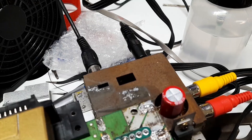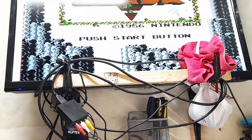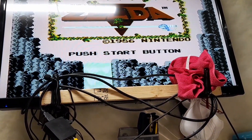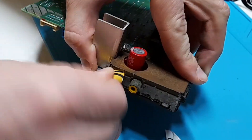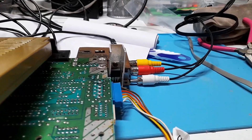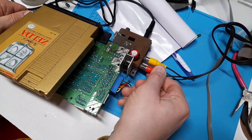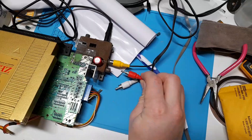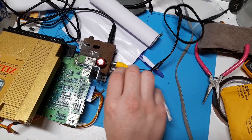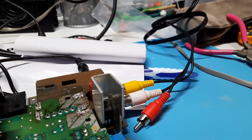There's no audio. This can be a few things which has me kind of worried. However, I'm going to try it with the RF cable first to see what happens. Perfect — that isolates my problem a little bit more. I still believed it was the ports, so I used a fine grit sandpaper just to clean them up a little more, and they were pretty dirty. And it still didn't work. I was getting worried that I was going to have to troubleshoot for a few more hours, but then I decided to try something really, really simple just in case. These were my personal tester cables, which I used to diagnose multiple systems — it just happened to be a fluke that they stopped working on this system.